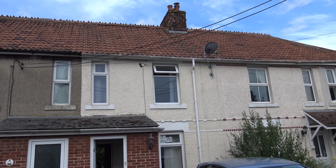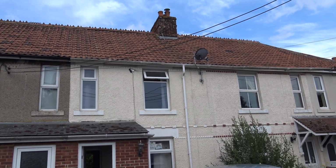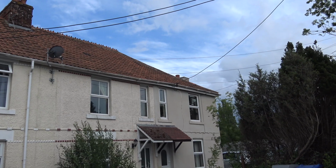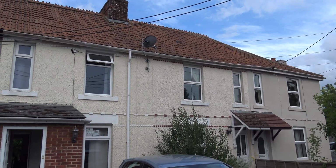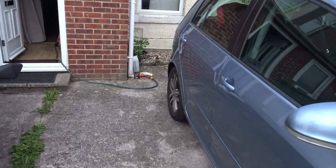At a property today and there's some damp problems internally. You can see it's a mid-terraced house and you've got downpipe coming down. This one you can see, next one is down there, and as you go along here there's nothing on the return on that one as well at the end. There's a lot of water coming down here, so this is an obvious potential cause of damp at the base of the wall internally. So just going to show you some real basic stuff.